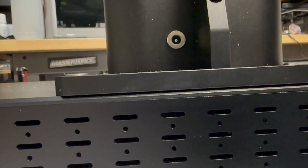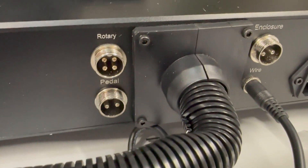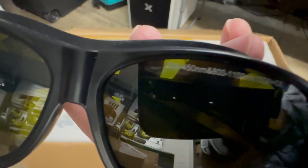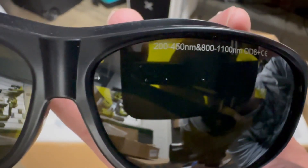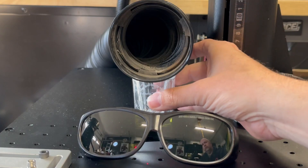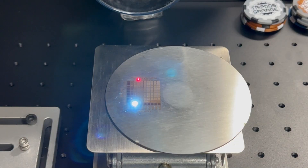You have a wire plug-in for your stepper motor for your Z-axis, your data port, rotary connection, pedal control, and an enclosure port. It comes with certified safety goggles — I would suggest definitely using them. Use the exhaust because you're going to want to exhaust any particulates. Safety first: make sure there is no one in the room while operating this laser, and always make sure your laser is attended.